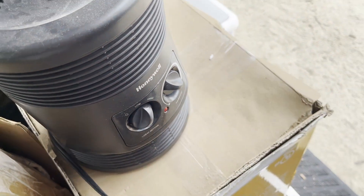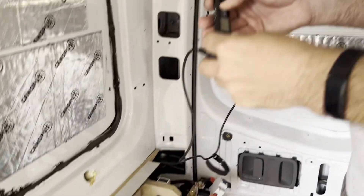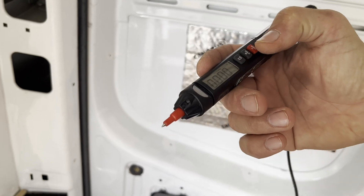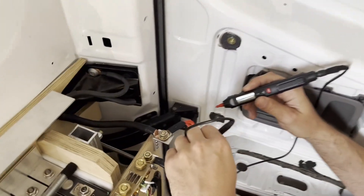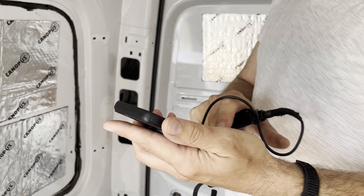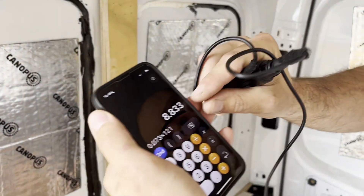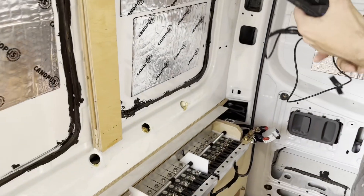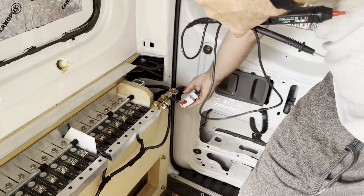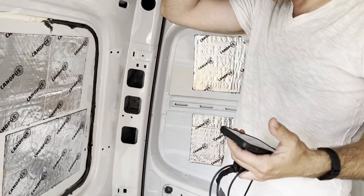Let's double-check how the circuit breaker is doing — nothing is heating up. Okay, turn it up to high. At high we are at 121 amps, which is the target range for this circuit breaker. I'm going to switch my multimeter to volts and measure the voltage drop across the pins. The voltage drop at full load is 73 millivolts. Quick calculation: 0.073 volts times 121 amps equals 8.8 watts. So at full load this circuit breaker dissipates about 8.8 watts — that's fine, it can handle that pretty much all day long.